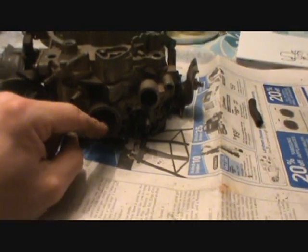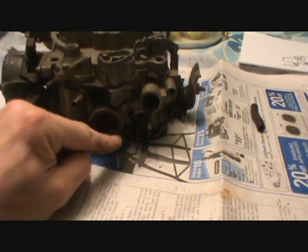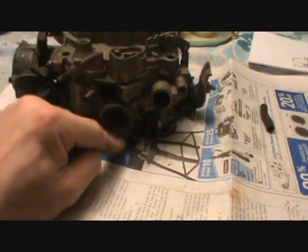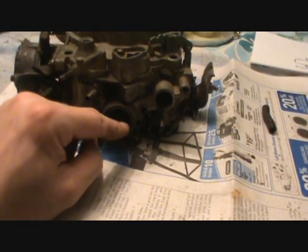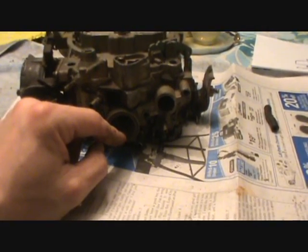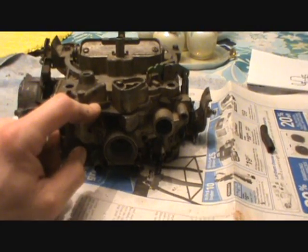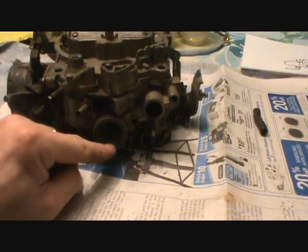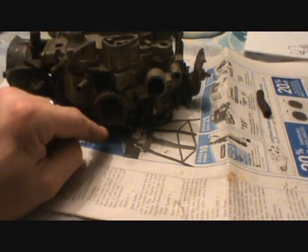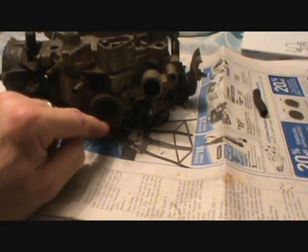That's where all that usually comes into play — that's why you see somebody that's just wrapped the threads of the filter housing with that good old tape. These Rochester engineers were not making the money they made for being idiots. They knew what they were doing, and if you follow what they tell you to do, you won't have those problems. I have never seen one of these leak that had the nylon gasket in place. I've never seen one drip.